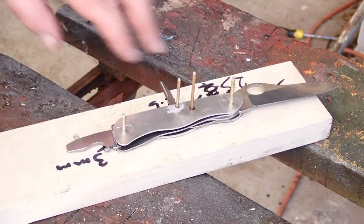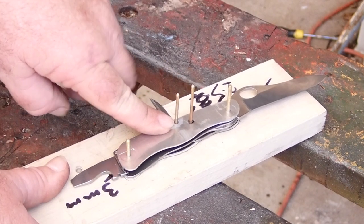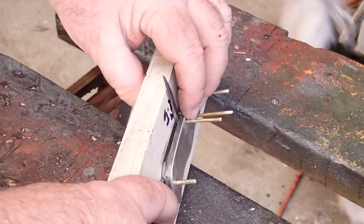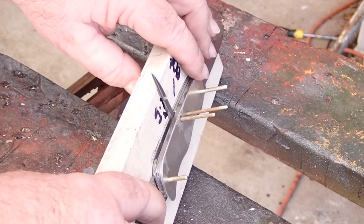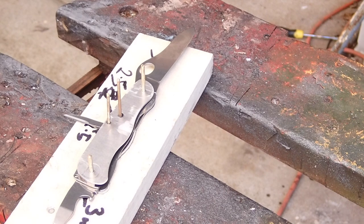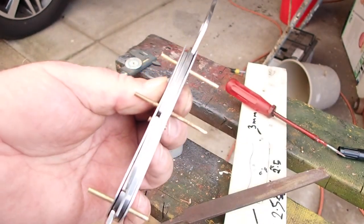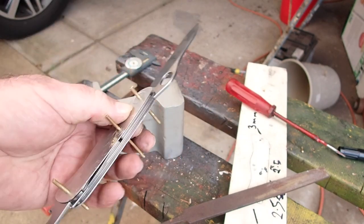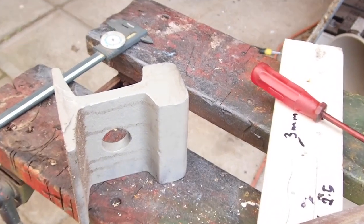Okay guys, it's all together. All I've got to do now is the collars. This pin here is a standard rivet — I'm pretty competent in doing that — and that will actually hold it together. I'll cut this one off just over a millimetre, then rivet it out, then put the collars on these. I've kept the tools straight out so it keeps the liner lock engaged — otherwise it's going to push this apart. I'll rivet, turning the handle on the side to miss the other one. Once the centre one's locked, I'll make sure I'm straight and tidy it up.